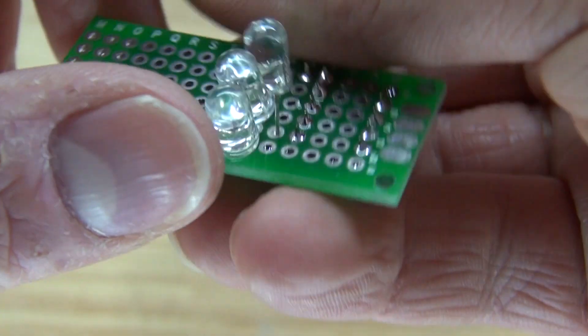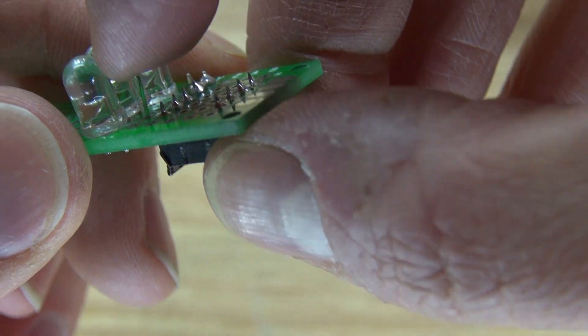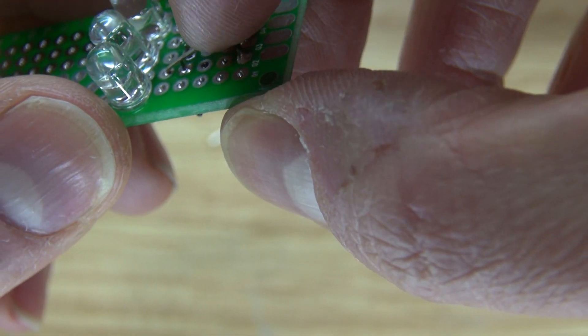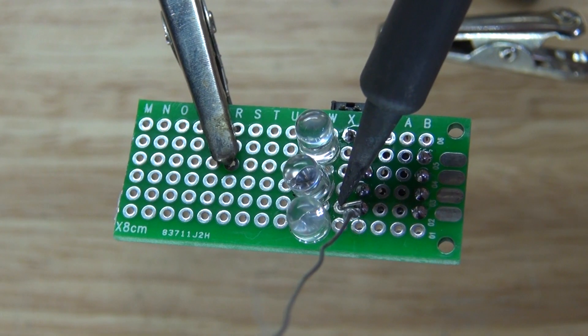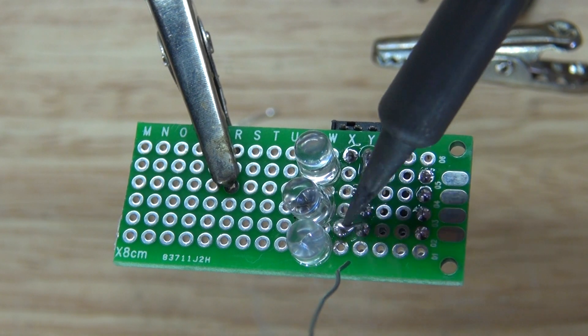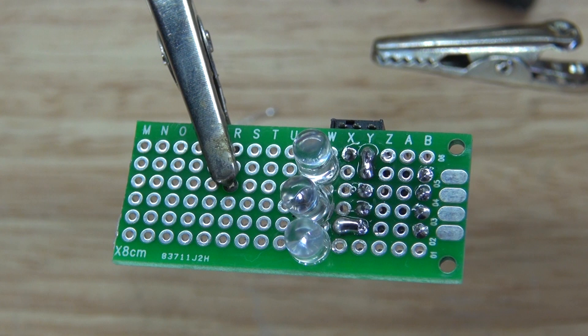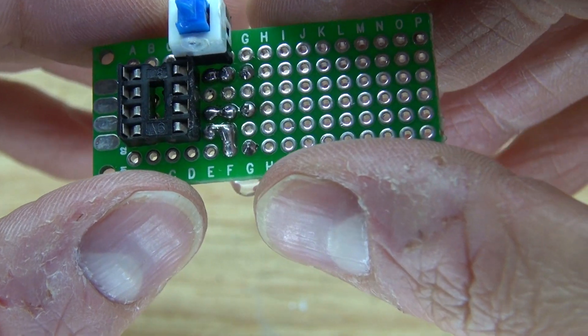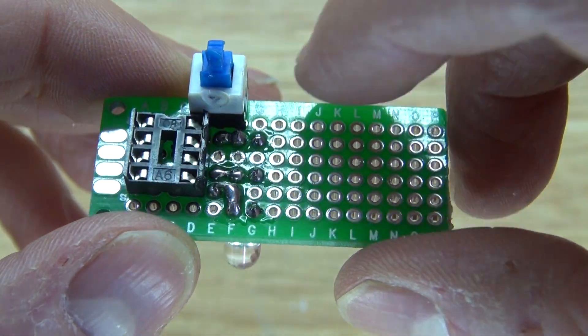Bend the leads over to the pin of where each LED needs to go, bridge it into place, and position it onto the perf board at pin five, six, and seven. Bridge them all together. All of the LEDs are now connected to the ATtiny.